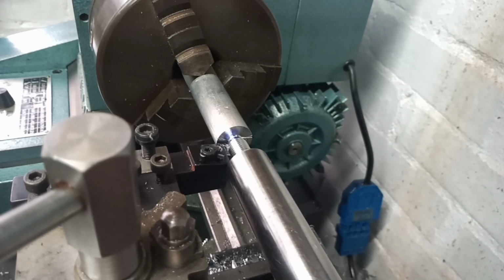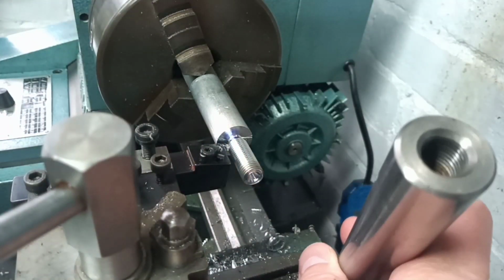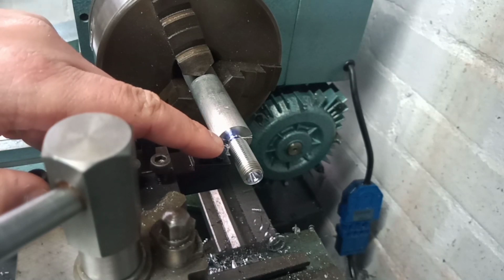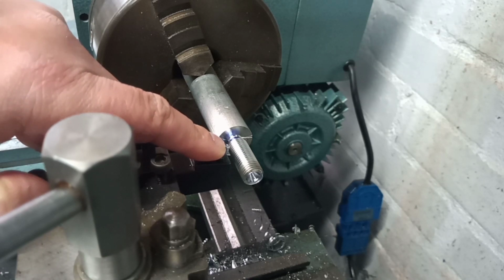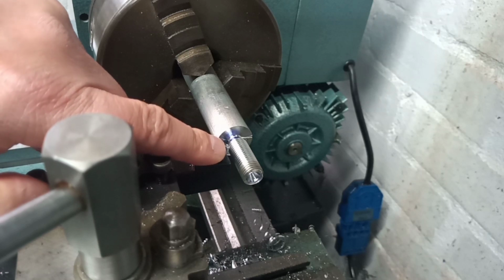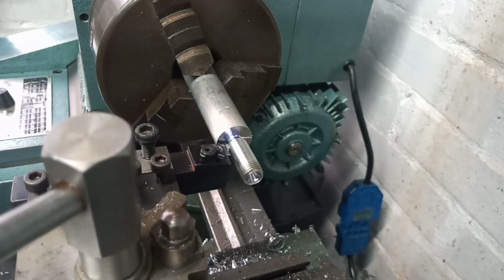Now, why has it got this thread? Well, I don't know. I think this must be an aftermarket part. Probably came supplied with matching bolts, because the original Bantam pins had a 7/16 British Standard Cycle thread, which is 26 TPI, and the later model B175, sort of last of the line really, had a 7/16 UNC, which is 14 TPI, a much coarser thread. So BSA never put this thread in. So yeah, I'm guessing it's an aftermarket component. But anyway, we know what we're dealing with now, so we can make our new bolts.